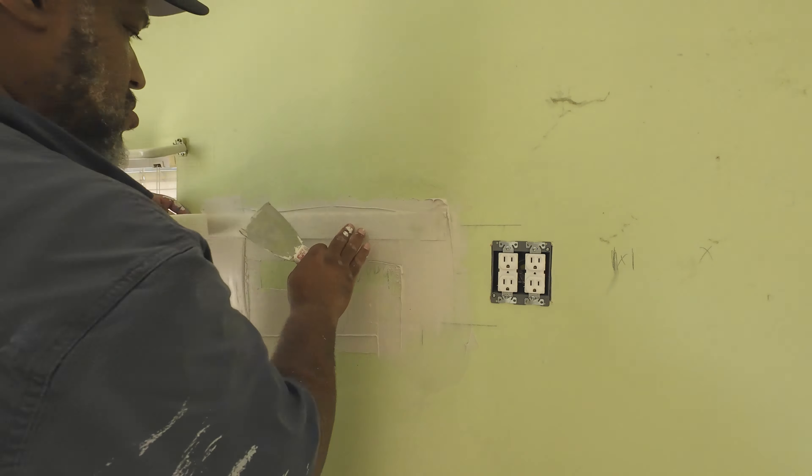I'm using the same piece of drywall — I just put it back up. Then what I usually do is if it's nice and clean, I'll just go ahead and put the tape up. But if it's not, I'll go along any edges that are frayed and cut off any paper that got a little messed up, because I just don't want any paper sticking up. To make sure the mud sticks, I'll sand it because it had a sheen on it — I think it was satin on these walls. Now I'm going to fill the cracks with 20-minute mud, then put embedded tape in there and another layer of mud over that. I'm also going to dry this one with a heat gun because I needed to go faster — I was trying to get all the paint done in one day.